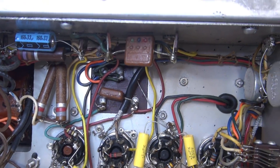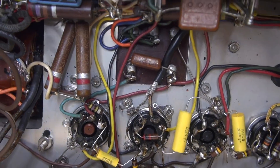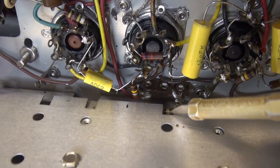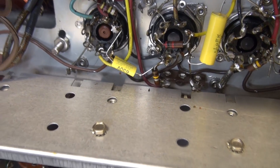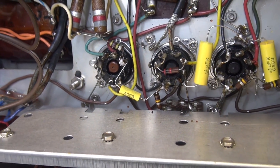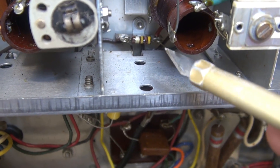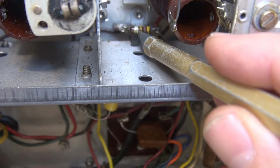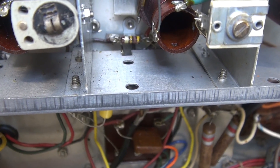I had a minor mishap — I was unwiring this terminal board and this lug broke. It's part of the game, time to put in a new one. That's a wrap on one side of the radio — all the new resistors are installed. Now we move up to this side. There's not as many resistors, but I do see one that could be a bit challenging. It's a 470K resistor, and he looks pretty sweaty — hiding under there. That one's going to be a lot of fun.